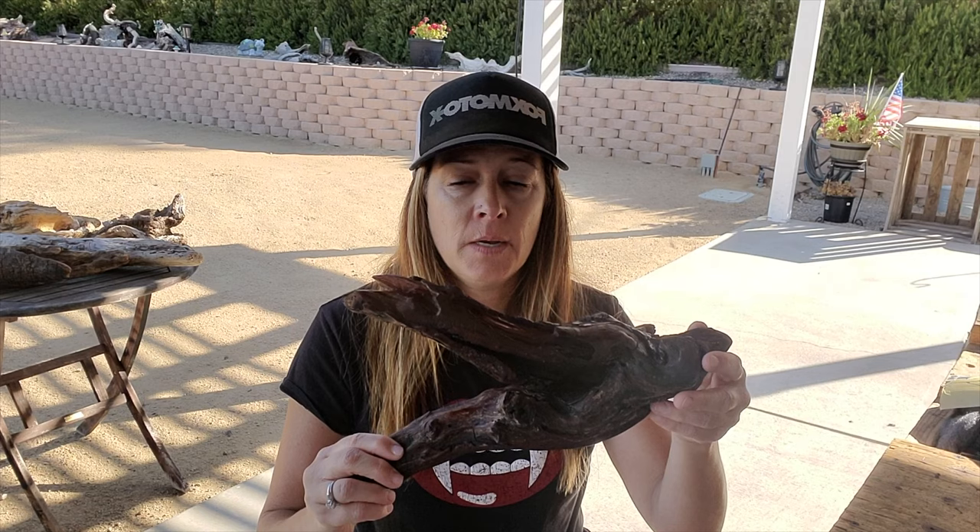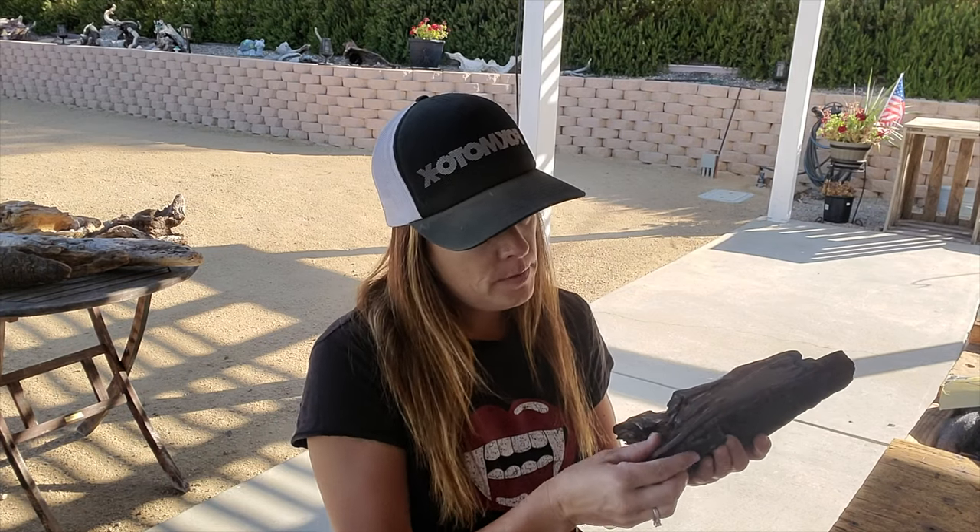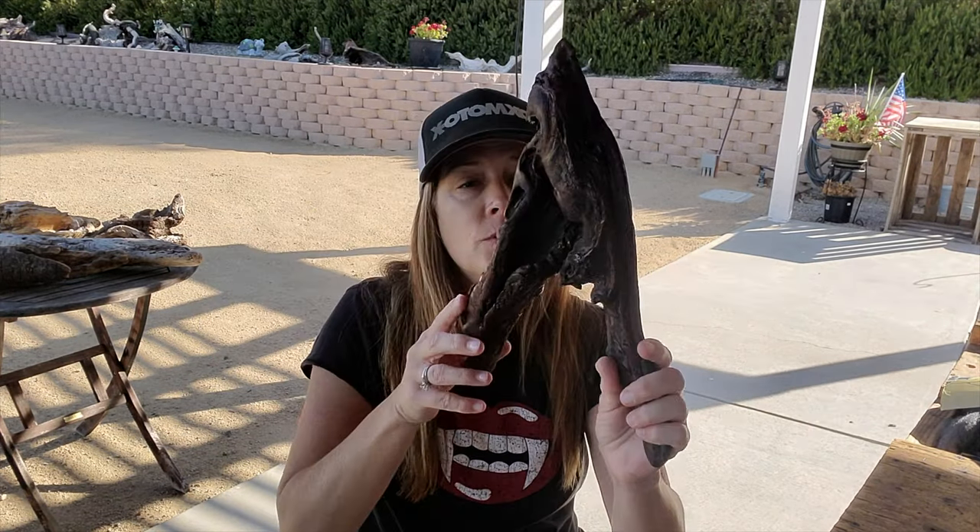This is the finished product of the wood we've been working on. I put the last coat on last night and this is what it turned out to look like this morning. There are a couple of spots where it's really shiny — I unfortunately put a little bit too much teak oil. So I might go ahead and lightly sand it down again to get it back to more raw wood, and then put just maybe another coat on it to see how it looks. You can repeat the process with sandpaper and steel wool if you want. It does look pretty cool. Those shinier spots are also because it's not completely dry — it soaks down into the wood and helps harden and protect it.